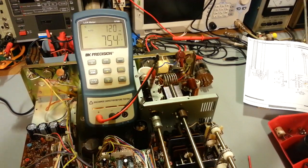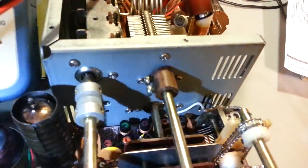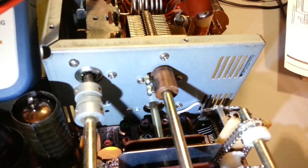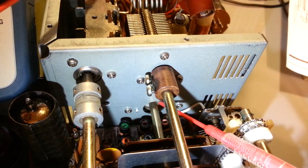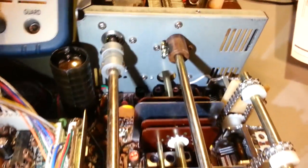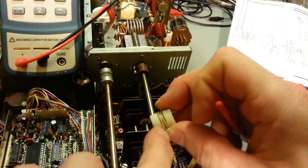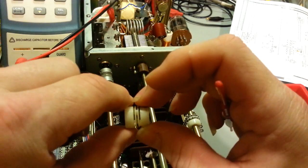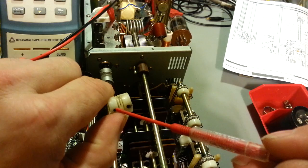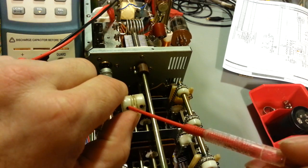And even with a little bit of further inspection, just looking at things, I did notice, let me try and get the camera down here a little bit. Yeah, you can kind of see it. If you see that dark line right there, that's actually where that shaft coupler used to be riding. They have the shaft coupler back in about a quarter inch farther than it originally was. You'll never be able to see it, but when I was looking in through the side, I can actually look through these slots in that coupler and see the impressions of the set screws where this shaft coupler has been pushed back farther. The impression that this set screw made when they got the other coupler in farther, I can now see it.